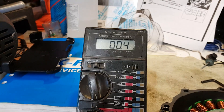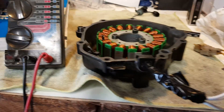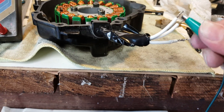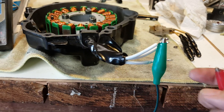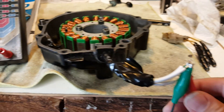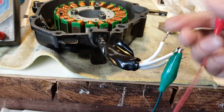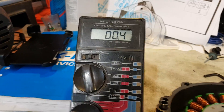We're going to move on to the other one — and with that one connected, 0.4 ohms, which again is in spec. Now, to show you that it doesn't really matter how you connect these things up, I'm going to connect this one over here and grab the bottom lead, and no matter where we connect it, you're still going to get the 0.4 ohm reading. And there we go.